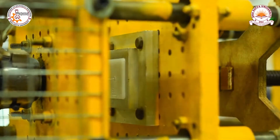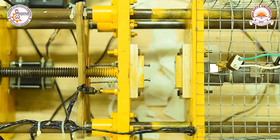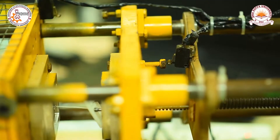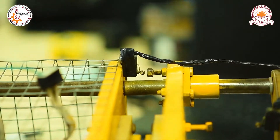As the mold opens, the ejection mechanism comes into working. A limit switch has been placed at both ends to control the motion of the movable platen.